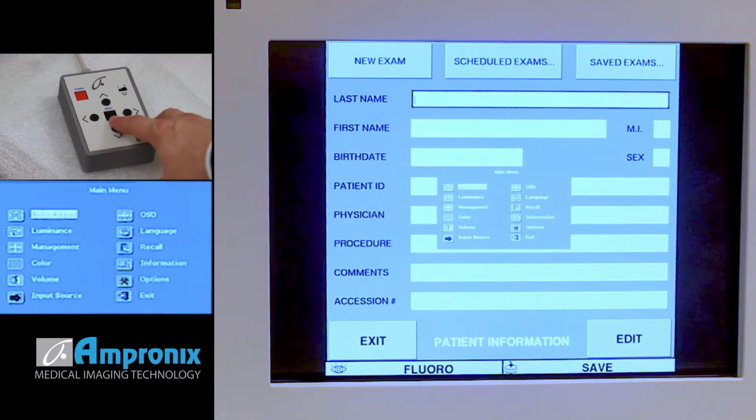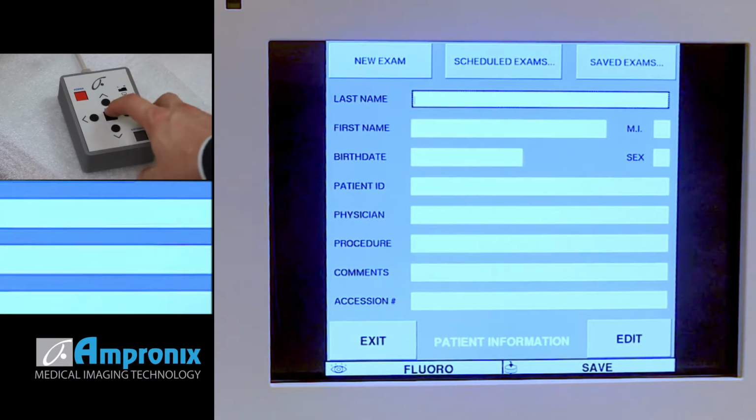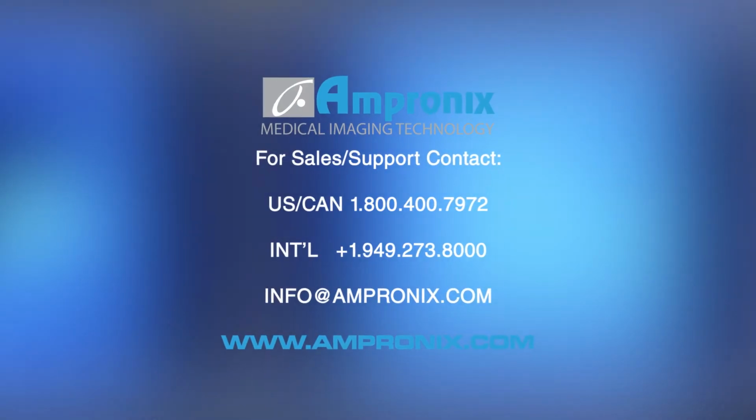On occasion, the monitors may need to be calibrated. Press the menu button and select the first option titled Auto Adjust. The monitor will automatically calibrate to the correct settings. For optimal calibration, it's recommended that you repeat this step 3 times in a row.